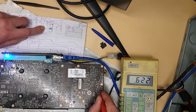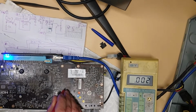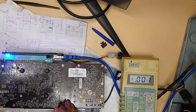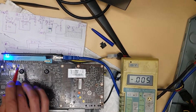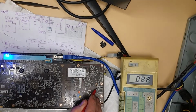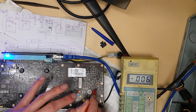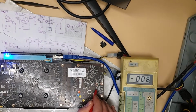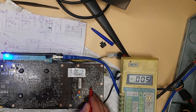And we don't have 0.9 volt. As you can see, we don't have Vcore. We don't have anything because we don't have a power good signal. Which was I talking about, a power good signal? It's basically, here you've got a reference board. You can measure it on this resistor. This should be the power good signal from this side. From other sides, I showed you there was a checking point, so you can use that checking point. But from this side, this transistor is gonna have power good.